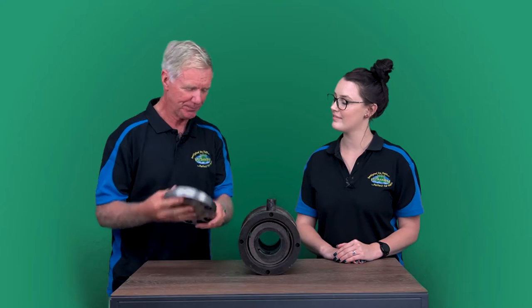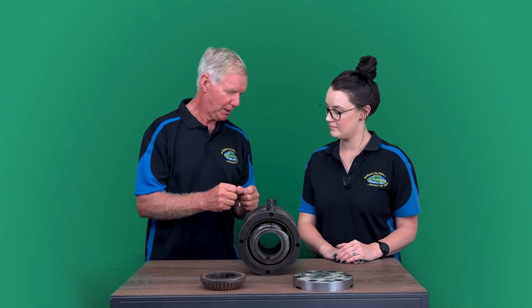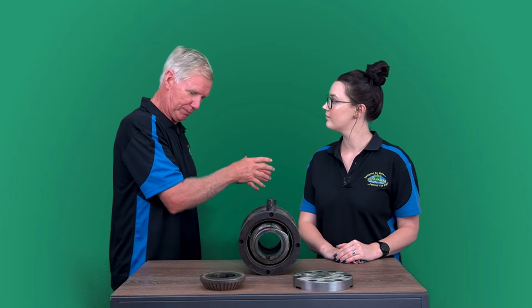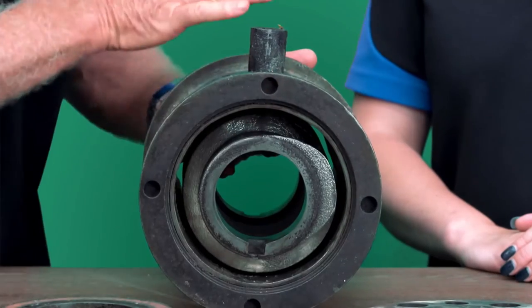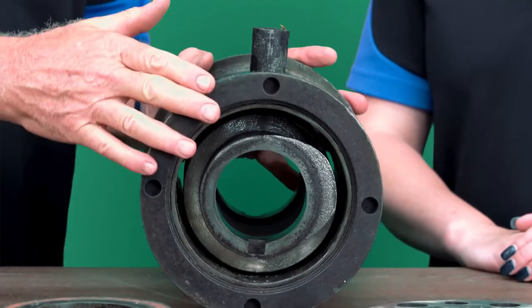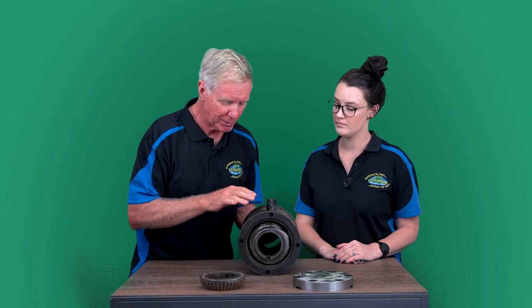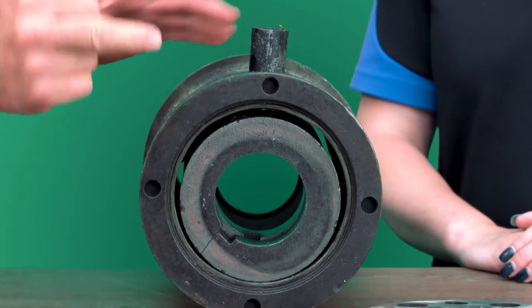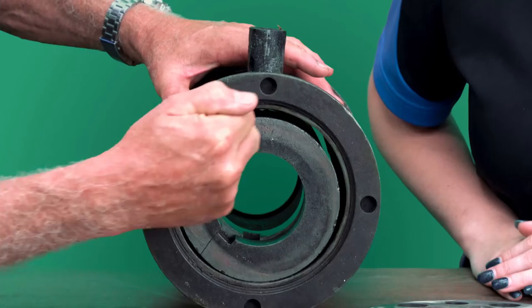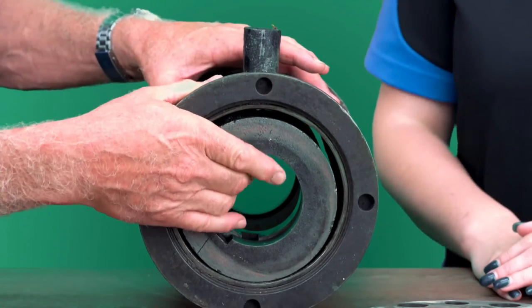Then on the end we have what's called a die plate, and it goes on the end of the machine. Now what happens through the process? Well, we grind all the ingredients to a fine powder. That powder is then fed into the back of the machine. As the powder is fed in, these flights or screws convey it forward. There are multiple chambers on that shaft — four chambers sitting end to end. As the powder is being conveyed forward, it comes up against a steam lock. The amount of space within the chamber and outside of the steam lock is really quite small — only a couple of millimetres all the way around.